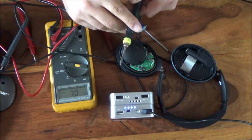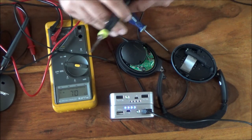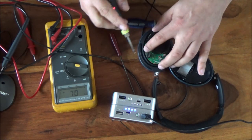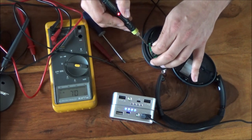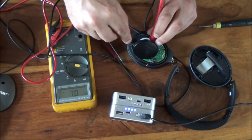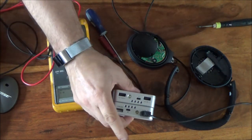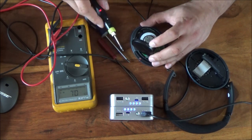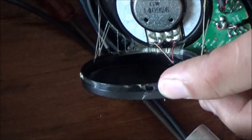Here's my soldering iron — this is a Silverline USB soldering iron. It's not amazingly effective but it's good for small things. We've got red at the bottom and silver at the top on the pins. This driver is completely open circuit — on the pins, nothing. So we've definitely got a duff driver. Let me fire the USB iron up again and retouch some of the solder joints in here.